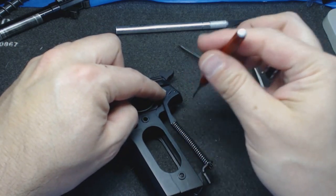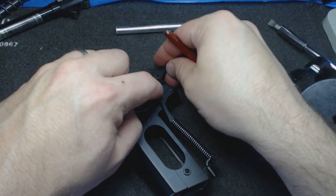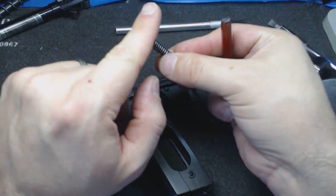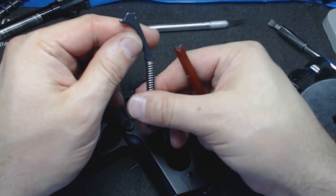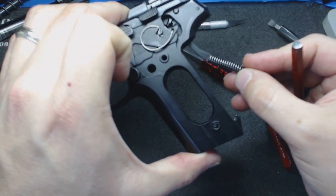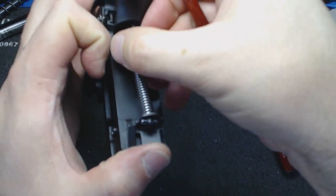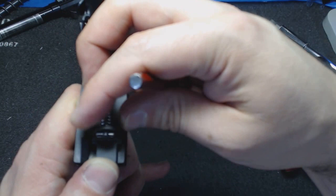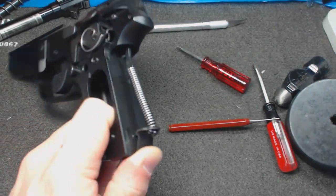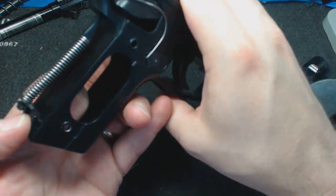So when this comes up, it pushes the back, which pushes the hammer around clockwise. But then this bottoms out in a position where the hammer has a little bit of flop, and then this spring pulls it to the back of the flop section. The point is that this tail bit is the back, not the front. So you should just be able to hook this around and see through the window it go right up on the inside of the hammer, and make sure it goes all the way to the back. And once it does that, again, you guide it up, guide its shoulders right up to the edge, and then take your trusty screwdriver to pop it right over the edge on the frame.